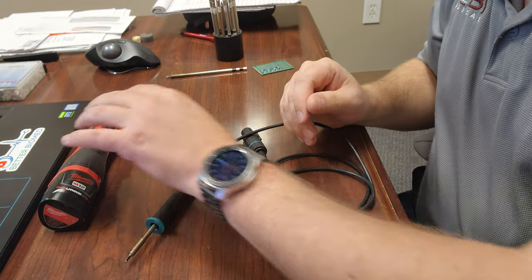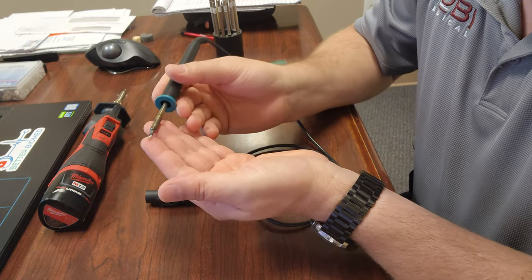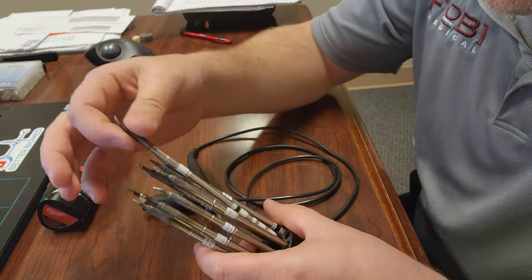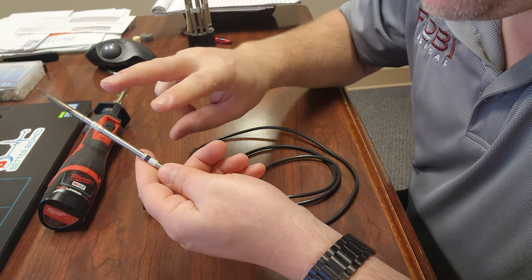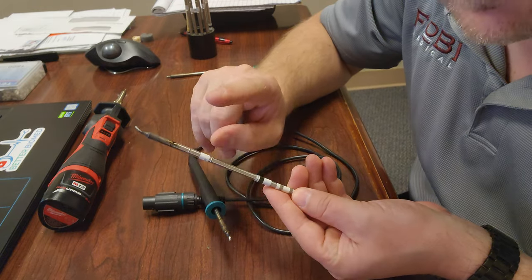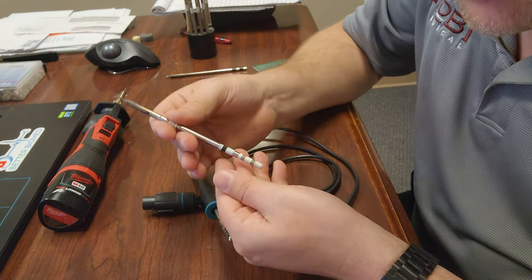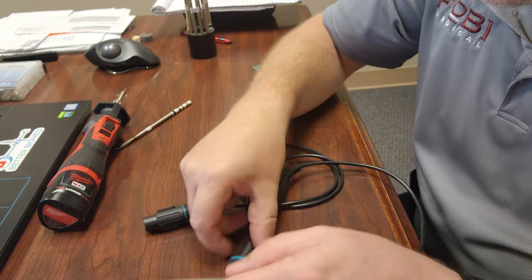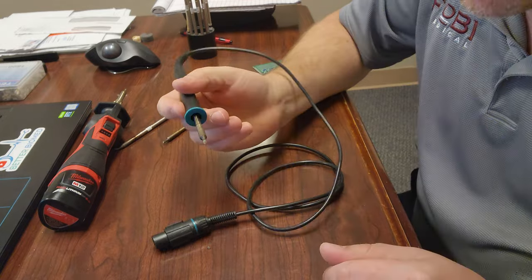This is a modern style soldering iron, and you can see it's got kind of a thin pin head here. Take a look and notice — it's got all these electrical contacts back here. It not only has the electrical contacts for the heating element, because the heating element is inside this tip, but there's also a thermistor inside the tip. So it directly heats and it directly monitors the temperature right here, all in one. If something goes wrong with this tip, like this one here is a bad tip — it does heat up but it immediately throws a thermistor error as soon as it's plugged in.